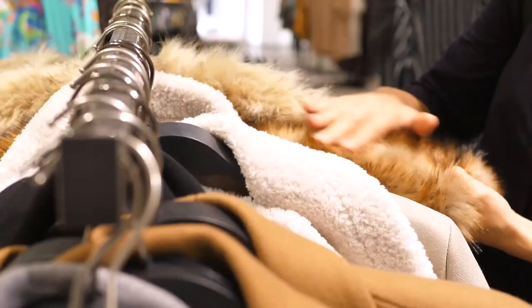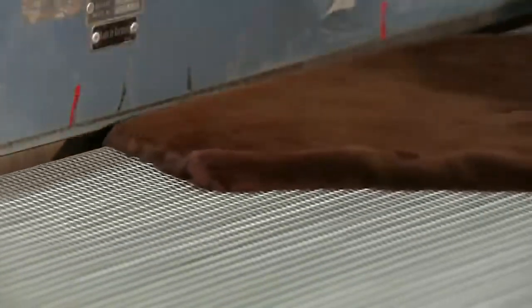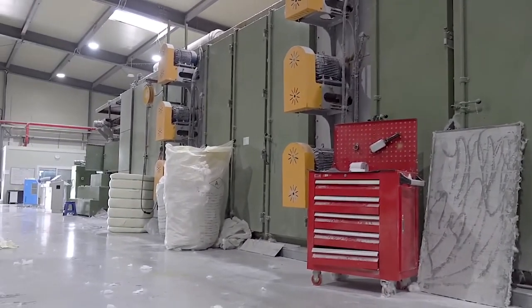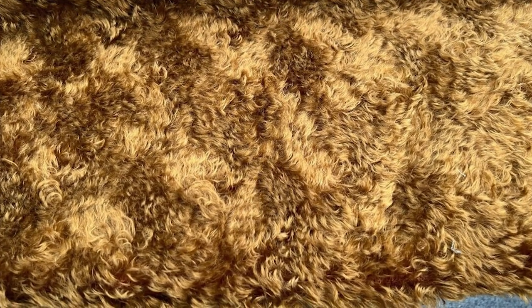To create a more natural look and feel, fake fur garments undergo several treatments. The fabric is first heat-set to prevent any changes after production and to improve its stability and fiber diameters. Tigering, using wire brushes, removes loose fibers from the fabric, while rough shearing with helical knives creates uniform fiber length. Electrifying the fabric with a heated, grooved cylinder in both directions can enhance its luster. Chemicals such as resins and silicones can be applied to improve the feel and look of the fibers, and coloring can be added to simulate specific animals. Additional rounds of electrifying and finishing shearing are done to remove any remaining loose fibers. Depending on the desired effect, embossing to simulate curls can also be applied.